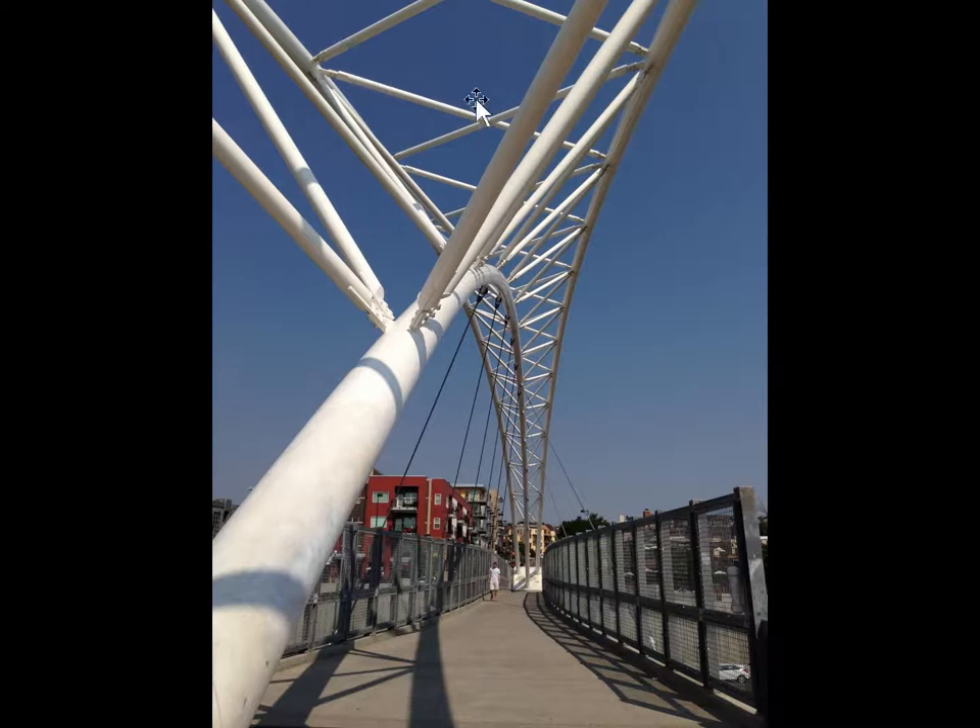You'll notice that the top plane of this is trussed in a pattern of overlapping web members — like Warren trusses where we have more frequent connection points. As a consequence, we're introducing joints here at the center. We don't normally do that because this joint is unnecessary and adds complexity, but in the case of this particular arch it makes it much more elegant, giving us a nice symmetric crossing pattern instead of some asymmetric pattern.